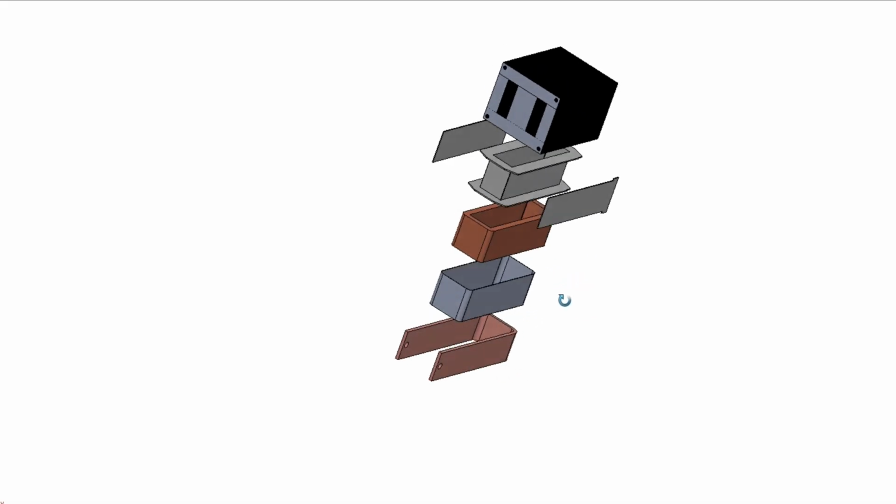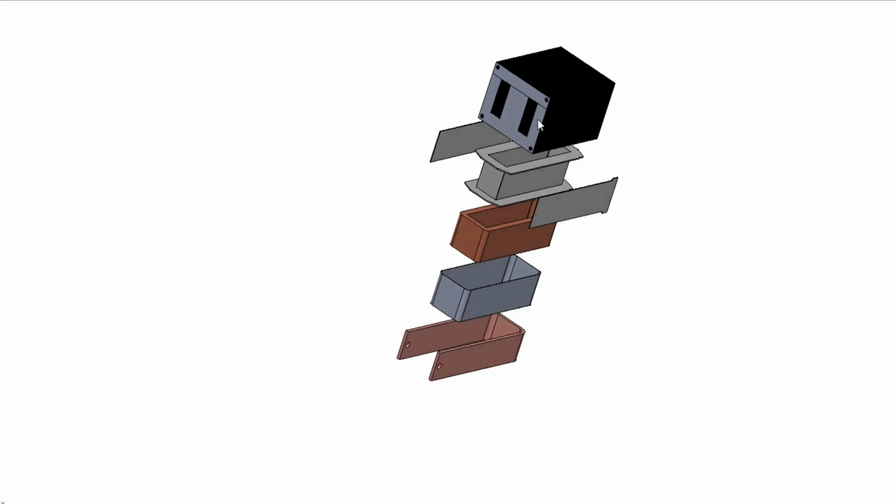But if you were to put round cable in there, it wouldn't have been very heavy, because this is wound different from transformer winding. Transformers are wound to one side. This is wound over the top of each other, so it's just done a different way. But they're still passing the core, round the core.